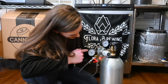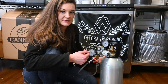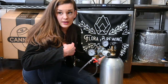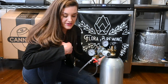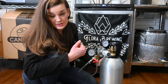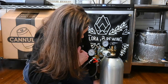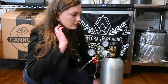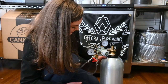Our high pressure valve went up to around a thousand. A full tank you'll get around a thousand PSI. I read that if you have one cooler it's going to be between around 600 to 800, depending on how cool your kegerator is. I kind of use this as a gauge to see when my CO2 is either running low or completely out. If you're completely out it will hit the bottom — I've also heard people say it'll hit around a hundred PSI and it means you're out. So keep an eye out for that.